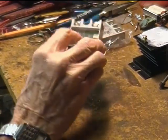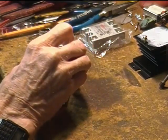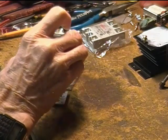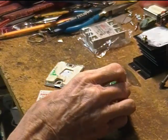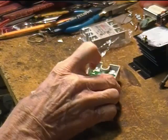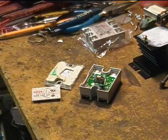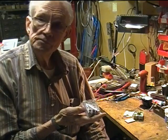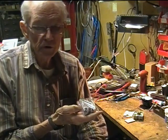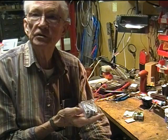Even though there's a screw hole here so you could reach through and screw that output transistor to the base, there wasn't a screw in the hole. It appears that it was squeezed pretty hard between the PC board and the base, so maybe that's okay. With a 25 amp transistor acting as the switch for a 100 amp listed device, I can confidently declare this device a fake.